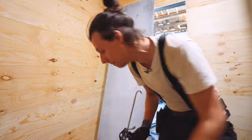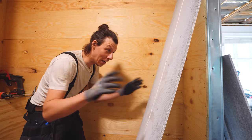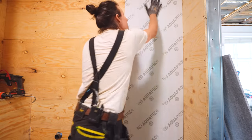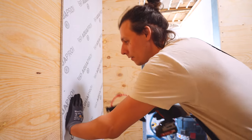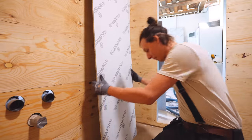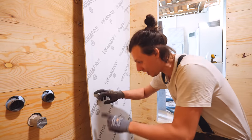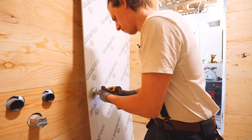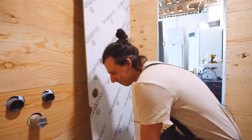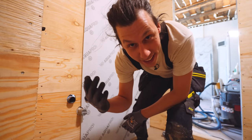For the plywood walls, we run one bead of adhesive down the center of the board, then screw on each side with regular drywall screws spaced about 20 centimeters apart — and this thing is securely attached. For the next board, we have obstacles around the water outlets and drain. I've marked out the locations, used a hole saw for the first hole, and a jigsaw for the second which is only partially on the board. I think we've got that pretty well figured out.